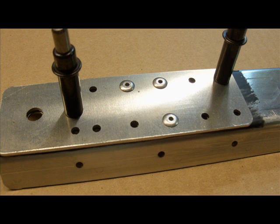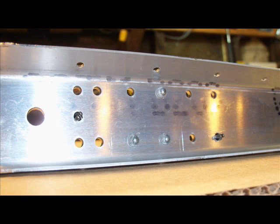Here's a couple of pieces of metal now on a wing spar, after I've joined them together using these devices called clecos, which are temporary rivets. You can see there's 3 permanent pop rivets in place right now, and you use these temporary rivets to make sure everything's going to fit, and then you start applying the permanent pop rivets, and that way you're reassured it's going to work.